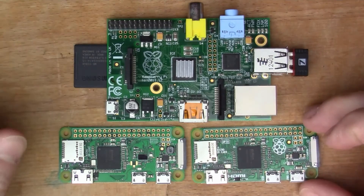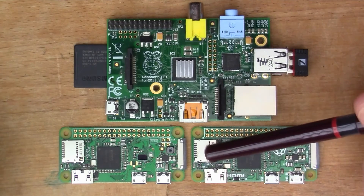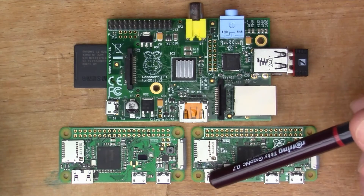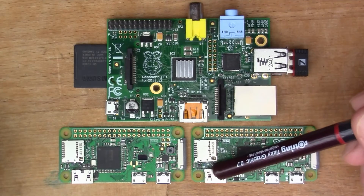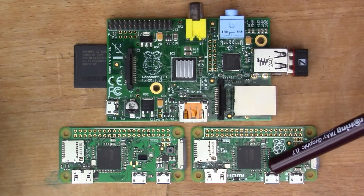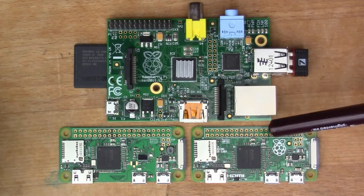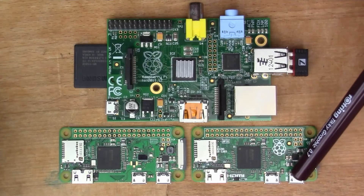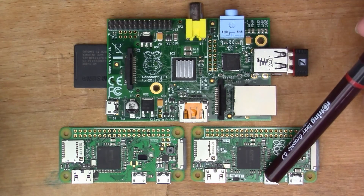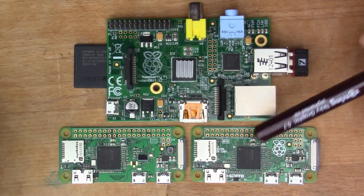The differences on these new smaller boards: there's the micro SD card now, and there's the smaller HDMI socket, so it's a more compact way of plugging into an external monitor if you want to do that. The Ethernet and the USB have been removed. Now we have a power socket here, and that other micro USB is a USB On-The-Go port, so you can put a cable on there and turn it back into a full-sized USB port.